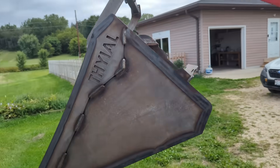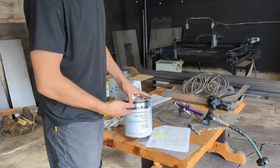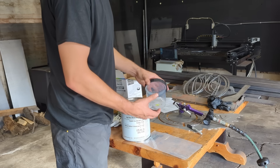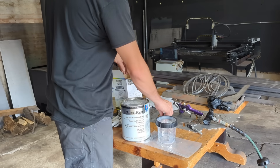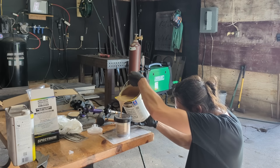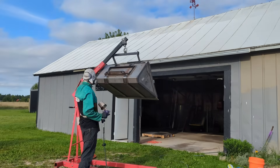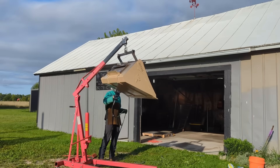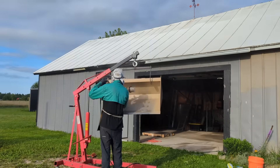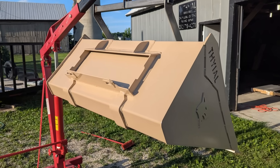I got her all wiped down with acetone and she's looking a little less greasy. I never sprayed this paint before so this will be interesting. This is Sherwin-Williams Surechem — on the data sheet I'm supposed to mix it at 10 to 20 percent volume. I picked up this fancy kit from Harbor Freight — it has a reusable measuring cup, a mesh filter top, and disposable liners. When you're done painting, you just take the cap off and throw the whole thing out. I quick painted this up outside — it was a little windy but not too bad. I had to wait about three or four days before the bucket fully cured where I could dig my fingernail into it and it wouldn't scratch. Would I have rather gone to a powder coat? Yes, but we can talk about that in the future when we start selling a few pieces.